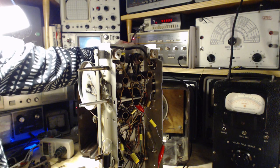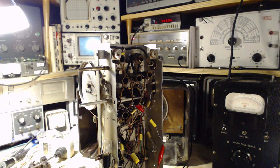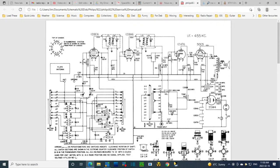so the next thing I'm going to do is I'm going to include another meter. I'm going to measure the voltage of the AVC. Let me get that set up here. Turn down the radio here. So in a lot of radios, you can pick up the AVC voltage on the top of the volume control, which would be here. Oh, here we are. Now let's see. Will that work? The top would be right here of the volume control. And if we slide this from phono to radio, you see these two are now connected. Phono is disconnected down here.